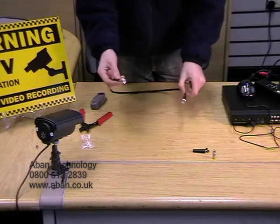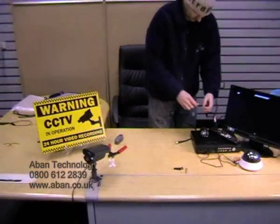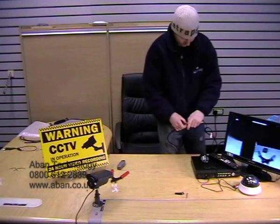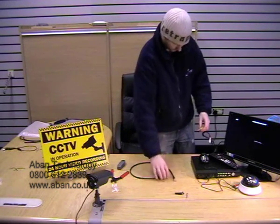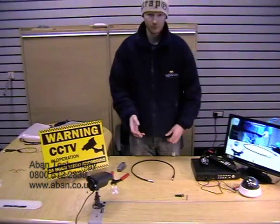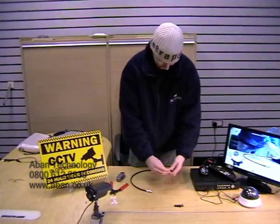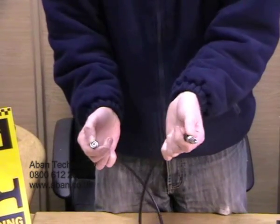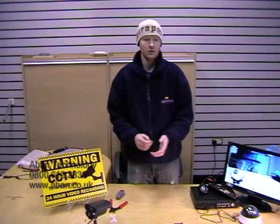Just to test that this works, I'm going to place the extension bar in the middle. I'm going to disconnect our camera and then connect this end to the DVR, and as you can see there's a nice connection to the extension cable. Now if you wish to make a BNC to RCA cable, we have our Phono socket and this is then just pushed in like so. We then connect one end to the DVR and the other end into the socket on the side of the TV. Thank you for watching today's tutorial — if you have any questions you can contact us on the following link.